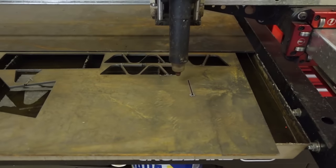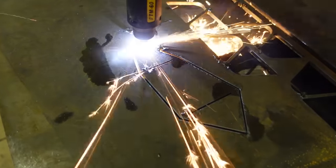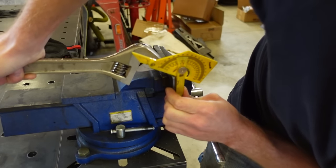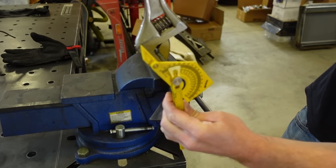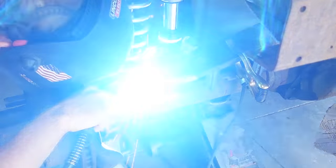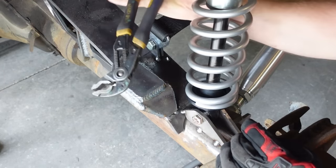And then after that, we are going to do a little work on the front shock hoops. Now, I had a couple of buddies comment and suggest that I tie in to the actual tabs on the mount, just to strengthen up where the shock bolts onto the mount. So I am going to tie that in. Now we do need to put another flange in it so that we can unbolt it. And I'm hoping that everything stays in place when we weld it, because all this stuff does move around a little bit. And when you have two mounts on each side, if something moves a little bit, it's gonna be off and it's not gonna be able to bolt together. So we gotta take our time building this little tie in just so everything will actually bolt back together.